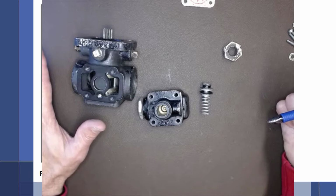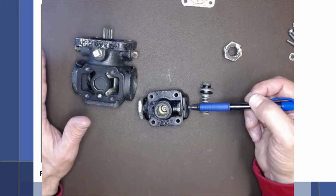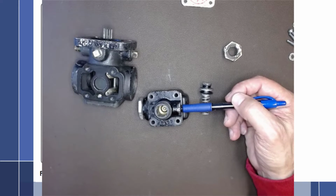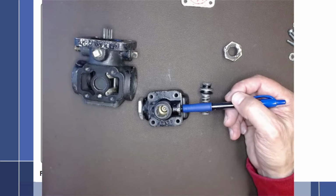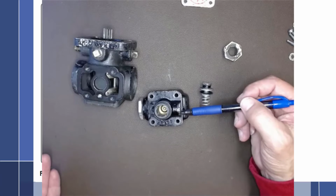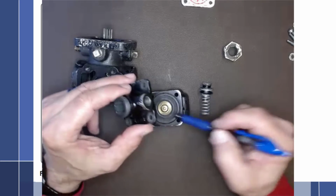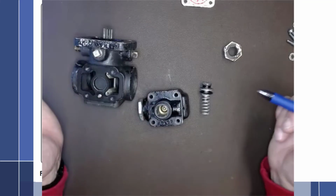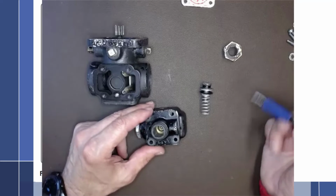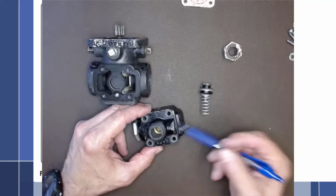Once it spools up and puts pressure in here, at the same time we got pressure here. Now we're getting pressure across the throttle valve going into the manifold, and now we're ready for more pressure. Until we're ready for more pressure, we don't want it, and tying it into the vent right here does assist in timing that. So once again, just because I know that was a little confusing, when it is not turbocharged or supercharged, it's just vented to atmosphere.